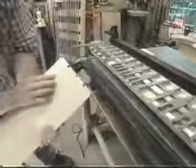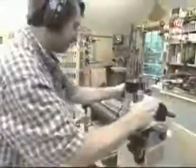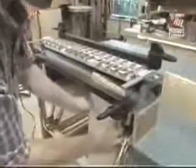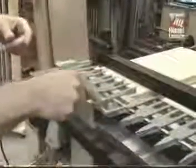All right, that's good. Now we'll move to the other end of the jig and do the other side. Okay, that takes care of the other side. Now we'll set up to make the pins in the drawer front. Okay, now I've set the drawer front on top of the jig, set up a stop, flip the fingers over, and now I'm ready to machine the pins.